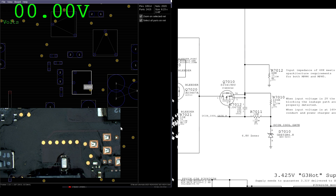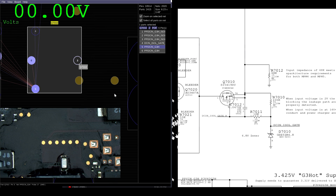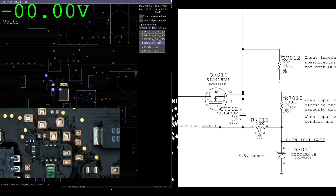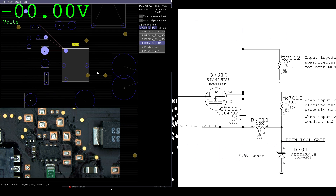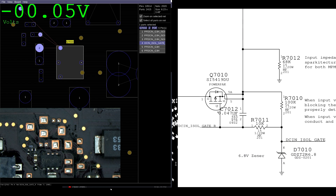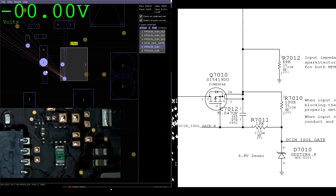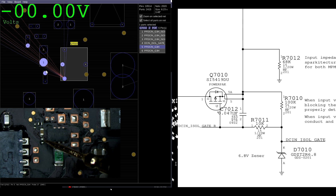Source is pin 5 and drain is pin 1. The transistor on the board view is tall, and the transistor on the board is wide. I'm going to check pin 5 — I want to see what's on input. I know that pin 5 attaches to the two things next to it, and I know where those are. Over there we get 18 volts.